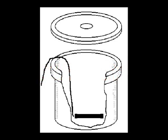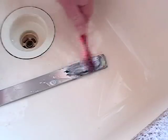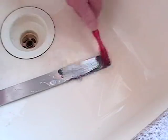After carrying out the surface preparation, the part needs to be degreased. Immerse the part in the SP degreaser, ideally operating the solution at temperatures higher than 140 degrees Fahrenheit. Sometimes you may need to use a small brush, like a toothbrush, to remove caked-on buffing compounds. Do not handle the parts with your bare hands after this point.